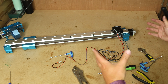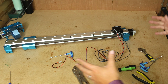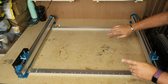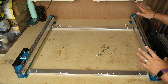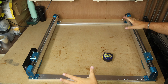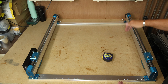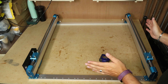That is the final axis done. We need to tidy and bind the wires a bit, but that's the hardest part out of the way. The next part is assembling them back to the frame and getting the spoil boards in place. We've got the braces for the y-axis on the bed — the holes for the spoil boards should be pointing towards the outside, and the one with the cable goes at the back. Take the locator pins from the previous ones, drop the y-axis on either side, get that in place, and hold it down with bolts. With all bolts finger tight, check that the machine is square by measuring corner to corner diagonally — both measurements should be exactly the same.